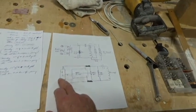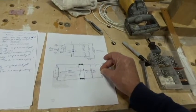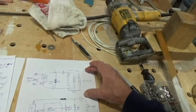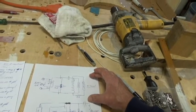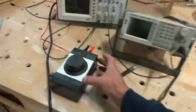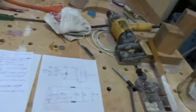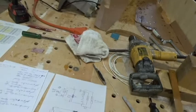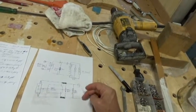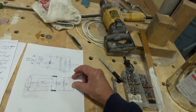This drawing shows how it all goes together: the HV transformer, the Terry filter, feeds through the resistors into the safety gap, into the arc gap, and then onto the LC primary — which is the capacitor and the primary windings as a series unit. This up here represents how to figure out what the tuning frequency should be after I know the secondary frequency. I'm going to use my oscilloscope and my signal generator, and this homemade Tesla coil tuner, to figure out what the secondary frequency is with the toroid on it and a simulated six-foot arc wire. Then I'll tune the primary to match that same frequency.